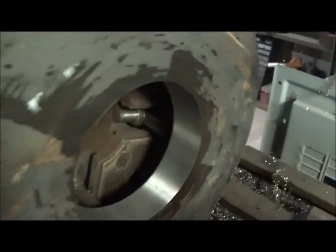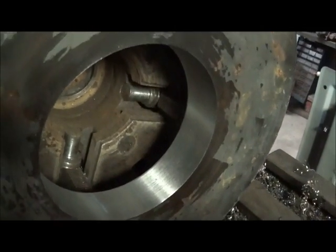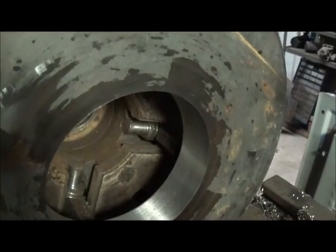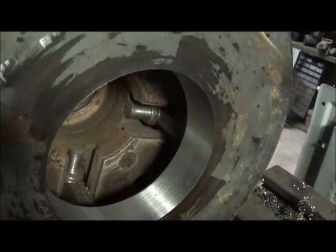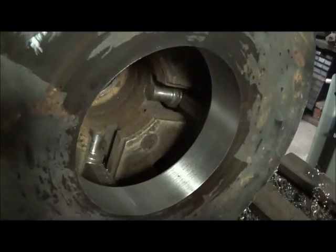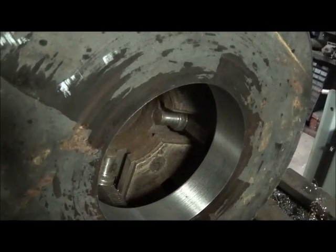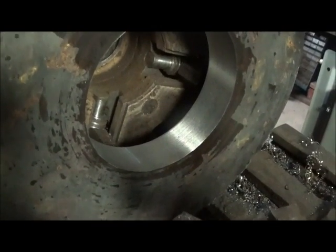They cut it a little small, which I'd rather it be small than big, but that's what I was meaning about it taking me a lot of time. And it's an old machine, you don't want to take so much off anyway, and even if you're using carbide, that's what is hard on older machines, because they're not made for taking as big a cut, as far as I'm concerned anyway, especially one 145 years old. But next time you see it, it'll be on my Gorton 9J vertical mill, and then we'll stick it in the indexing head, and we'll start indexing some holes in. But I'll go ahead and get this finished up.